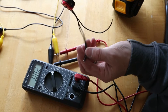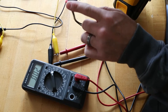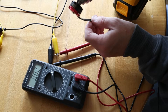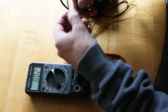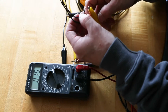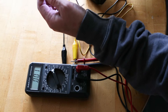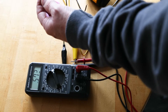We're going to check the three phases: the left one with the center one, the center one with the right one, and then the right and the left one. That completes all three phases. What we're looking for is an equal voltage at full bore from the drill each time. Now testing the right one against the center one — drill on speed two, spinning as fast as it can, clockwise. Here's number one — roughly 5.7 volts.